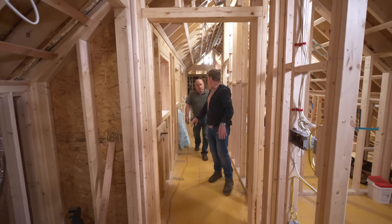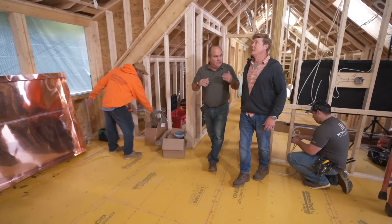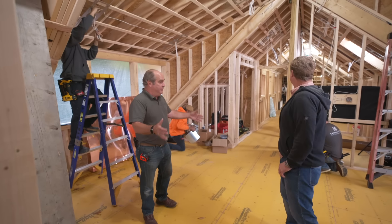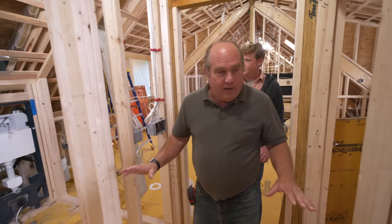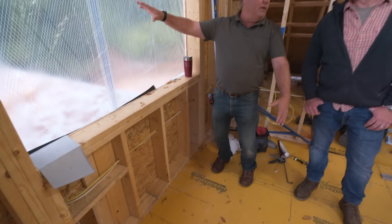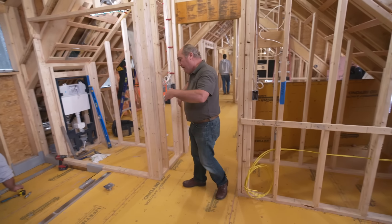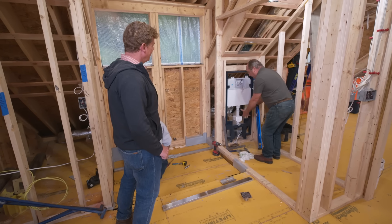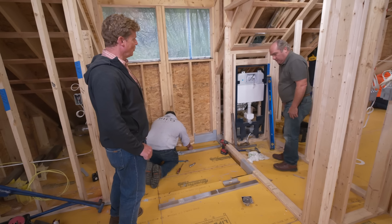The place is hopping with every trade on top of each other — HVAC, electricians, plumbers, all trying to get their work done. This is the whole bedroom suite: the bed will be out here looking out at the meadow, everything oriented to the beautiful backyard. There's a nice big shower and bathroom area with a soaking tub to look out the window, a couple of lavatories with good light, toilets tucked in. And this is interesting infrastructure inside the wall to allow a wall-hung toilet up off the ground — nice and hygienic. This is the tank that stays right inside the wall; it requires some serious infrastructure.